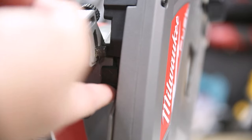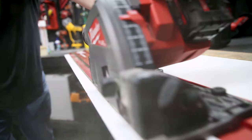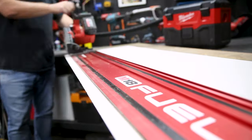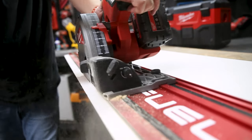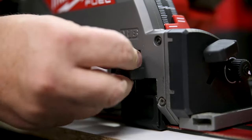If you're cutting melamine or veneer and you want to stop breakout, you can do a scribe cut by flipping this switch here, and that'll auto-stop the saw at scribing depth. You won't get breakout on the track side of the blade because the leading edge of the track is an anti-splinter strip. But if you want to avoid breakout on the other side of the blade, there's a splinter guard that comes with the saw.